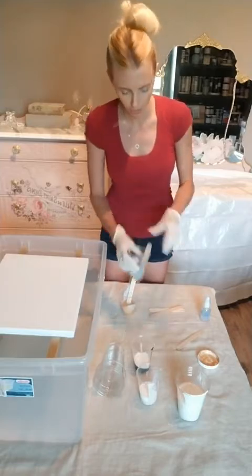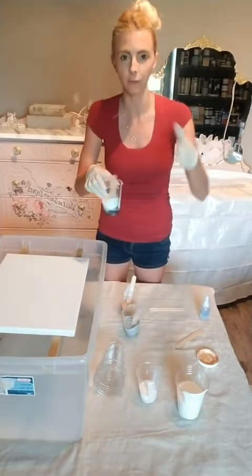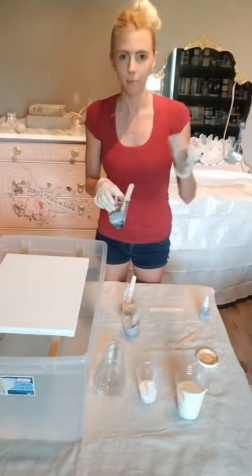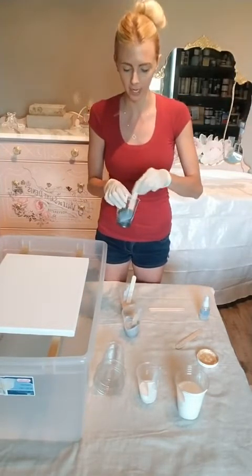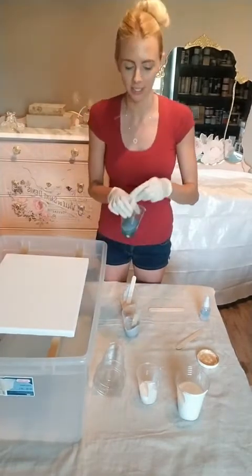With epoxy, you could do that, and then pull the tape off after you've created the dam, and then it'll self-level over the sides. But this isn't really gonna self-level if you don't. Basically, I just tape underneath my ledge, and then I put plastic all around, and then tape on the floor, and then I just let it flow off the sides. So it's messy, it's very messy.